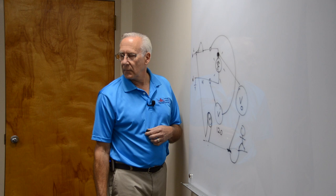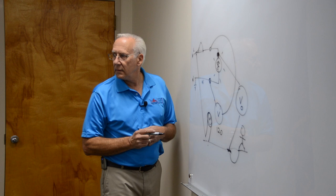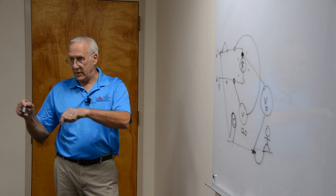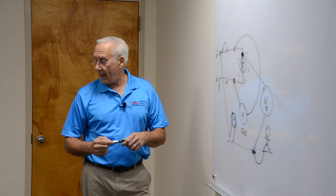Okay? If you're testing to see if the bulb is no good, you'd want to test it to the other wire. But that doesn't help you touching it. When you want to touch something, you want to reference your point to ground. Now, as you get better at electricity, you may not have to do that, but I'm telling you, for this class today, at your skill level, your reference point is the earth. Okay? I'm going to show you that. We'll hook this thing up and I'll show it to you, all right? Let's hook this thing up. Let's put some power to this. I have a bunch of things here we're going to demonstrate.